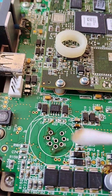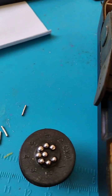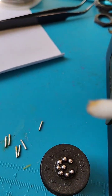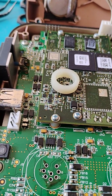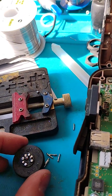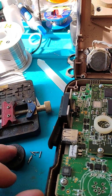I did go ahead and try re-soldering those pins directly on the connector. As you can see, the pins are tinned, the connector's tinned. But I was just not comfortable with that repair the way it was, so I ended up removing it again, cleaning off the connector, and doing point-to-point connections with wire from the connector to the motherboard. Now because of that, the physical mounting point is no longer the connection from the connector to the motherboard.